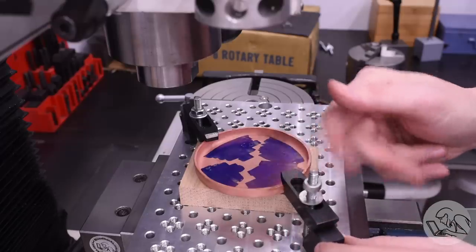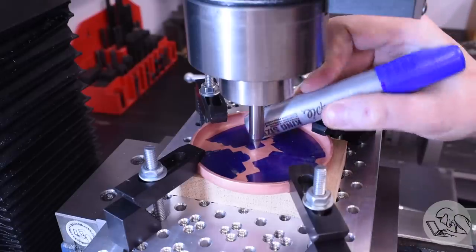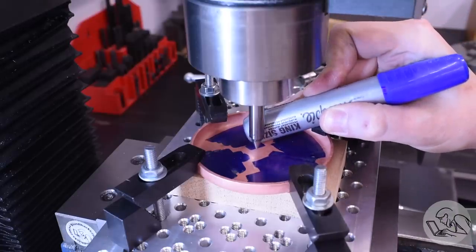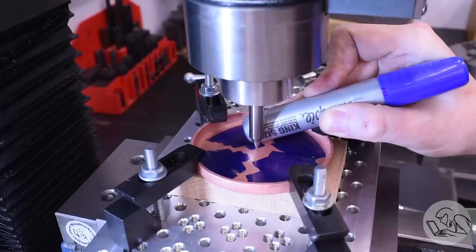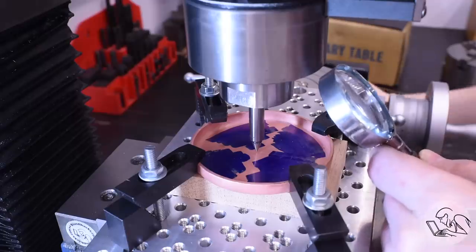Last time we hammer formed all of the main boiler sections, and so this is the front tube sheet, and we need a whole bunch of holes in all these parts now. So I'm going to start with the tube sheet here, and I've got my wiggler in there. This is the pointy end of a lot of edge finders. If you're wondering what it's for, this is what it's for.